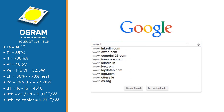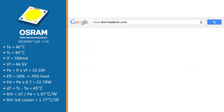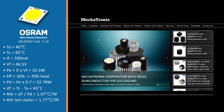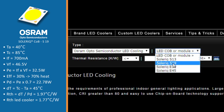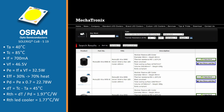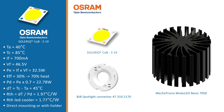With this value we can now find LED coolers which are also mechanically compatible to our Soleric S19. For that we go to our website led-heatsink.com, navigate to the Osram Opto Semiconductor section, and fill out the filter at the top. First we select our Soleric S19 chip-on-board module, then we fill in our result of 1.77 degrees Celsius per watt and click Go. The results that appear are all mechanically and thermally compatible with what you need to keep your LED at the temperature defined.